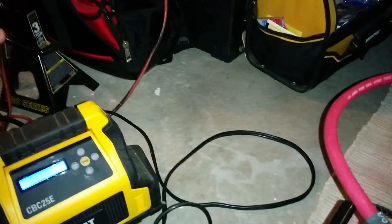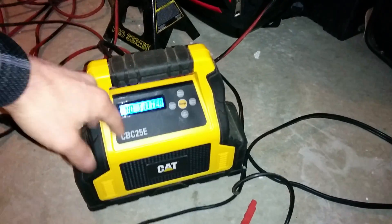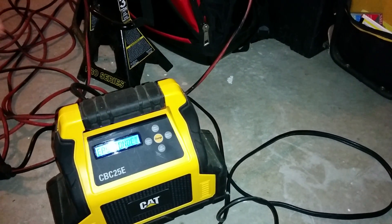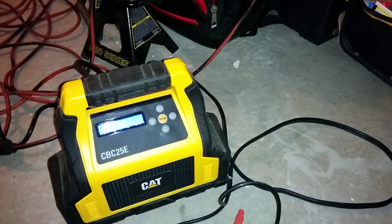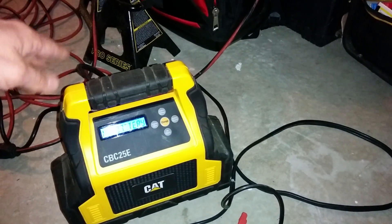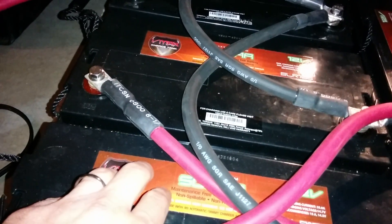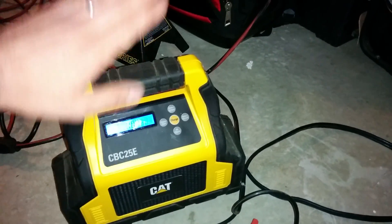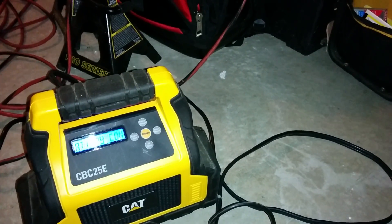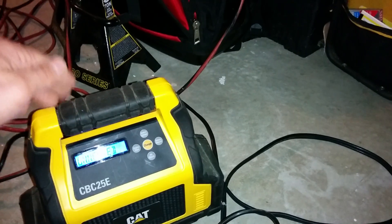Charging — not at rest — charging. I went through four battery chargers before I came to this one. I would hook them up, test them, and they would be charging at 13.2 volts, 13.6 volts, 13.3 volts — which will never, ever, ever get my batteries fully charged. No matter how many amps they push, it will never charge them. It needs to get them up to 14.7 volts and hold them there for a couple hours to get them fully charged. So be really aware of battery chargers. Test your own battery charger and make sure it's meeting your needs.